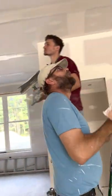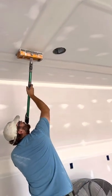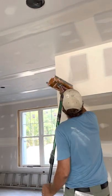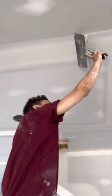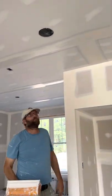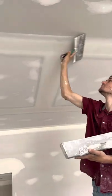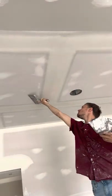I'm going to flip this down and lay another one in one second. He's going to wipe this in now — these two. We do this while it's wet because it's easier to blend them together. I could go through and run all the flats in the house, come back and run all the butt joints, but to me that's an extra step. Watch him — he's going to blend it right in now. I'll give him a check, and you see they're perfectly flat.